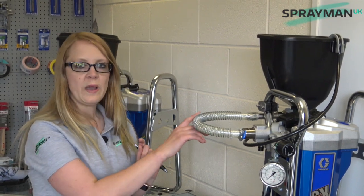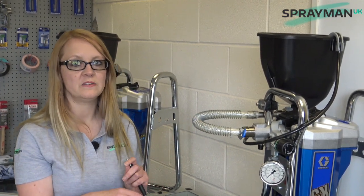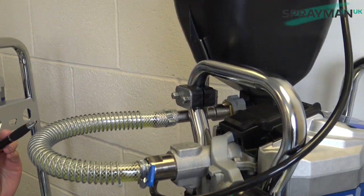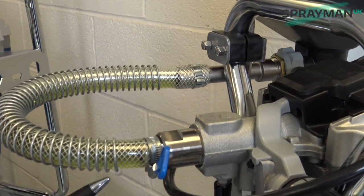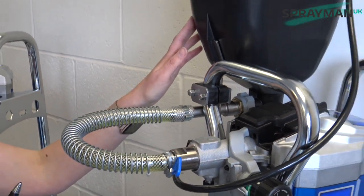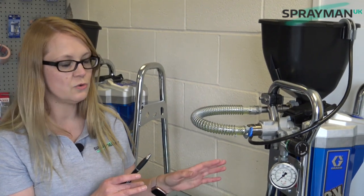There is a myth out there that there is wasted paint in this feed tube and that may cause priming issues. This is absolutely not the case and we can actually demonstrate this. As you can see here, the liquid is flowing through and the tube is filled. This is what we call a flooded pump inlet. There is no chance, as you can see, that you will pump air through the machine. The only way that could happen is if the hopper was empty, and that would be the same as any hopper with any sprayer. There is also no extra time with cleaning — when you flush through the machine as normal, the feed tube will automatically be cleaned as well. No time wasted.